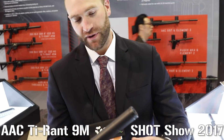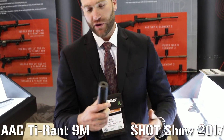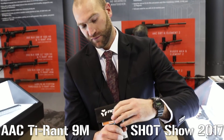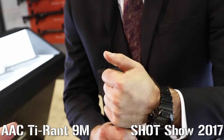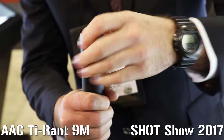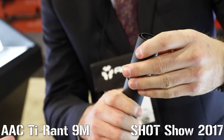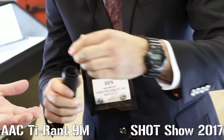The Tyrant 9M is a 9mm modular silencer, very similar to the 45M that we made a couple years ago. It's modular in that the front module can come off. All you do is unscrew your front end cap — refined threads, O-ring sealed. Unscrew your front module, and there's another O-ring. Both the front module has a front baffle and the bottom piece also has a front baffle as well as a transition baffle. All your standard baffles are backwards compatible with the old Tyrant 9 series.